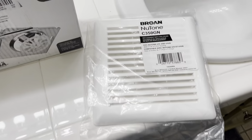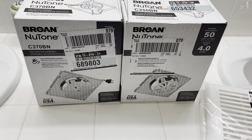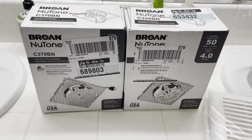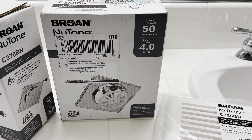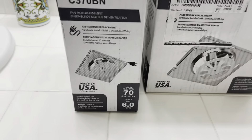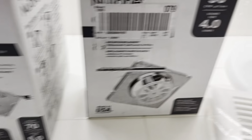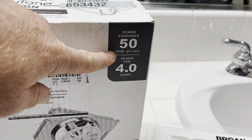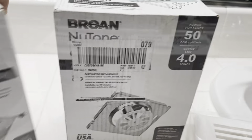This one's looking a little beat up and old, so I actually bought another one. Here's some of the replacement parts we're going to put in — there's the cover right there, that was $11. I got two different fan assemblies: one is 50 CFMs at four sones and the other is 70 CFMs at six sones. This one will be a little bit louder but more powerful; this one will be a little more quiet but doesn't push as much air. I'll put links to all these products in the description so you can check them out online.